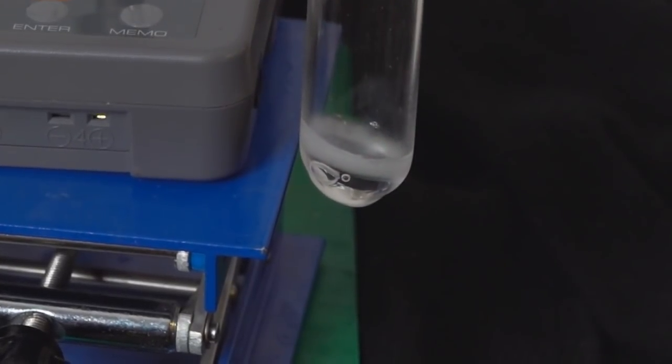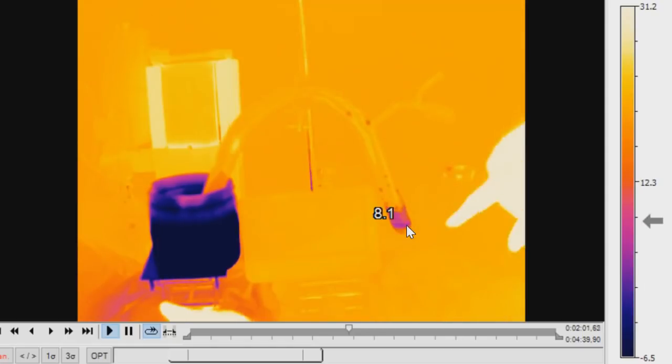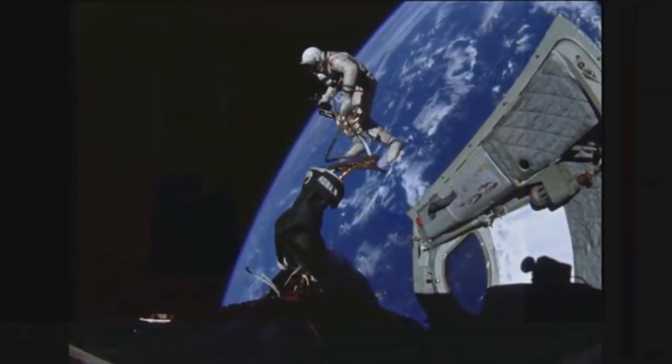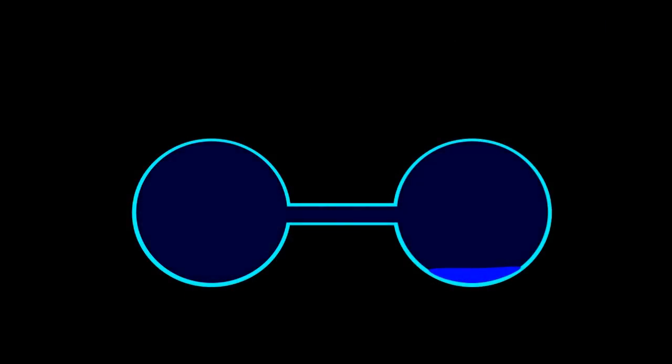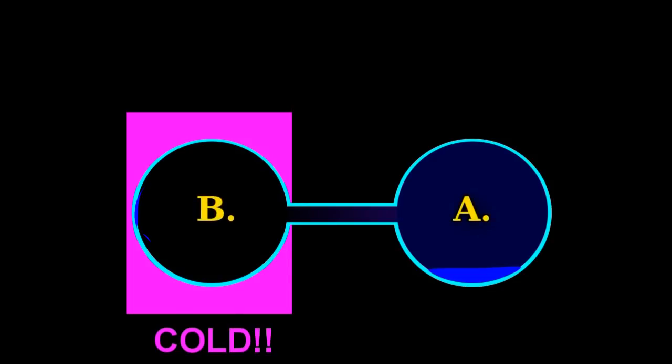That's one of the reasons why the Hydrovac won't work. This is probably one of the closest demonstrations you're going to get of just how quickly water will freeze in space — short of the slightly more expensive experiment of actually going into space and throwing a glass of water out of the window. When you're pumping to maintain a vacuum mechanically, you can only take a small volume out for every revolution of the pump, which is wholly inadequate for maintaining the maximum evaporation rate. But here, one side of the kit is really cold, so as soon as the water molecules hit the cold side, they instantly freeze on it — meaning the pumping rate is basically as fast as the molecules are hitting and condensing. That's pretty much the speed of sound. A cute variant of pumping called cryopumping.